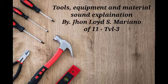Tape measure. Tape measure when working with wire. It is essential to know the exact measure when cutting and stripping, and a simple electrical tape measure does that. Another essential electrical tool is a pair of needle nose pliers, also called long nose pliers. It will be used for bending and twisting wire. Whenever you're making a screw terminal connection, the long narrow tip makes this a great tool for detail work. Most needle nose pliers also include cutting jaws and are used for stripping wires.